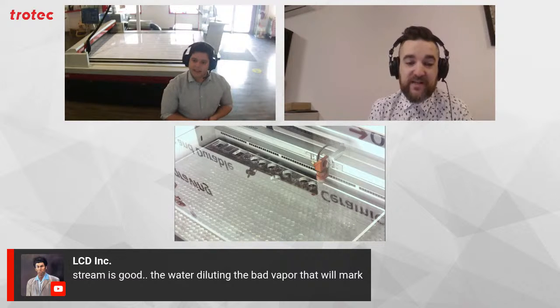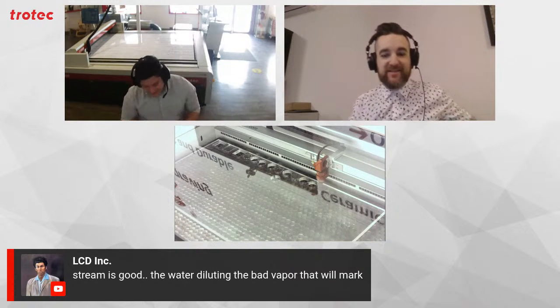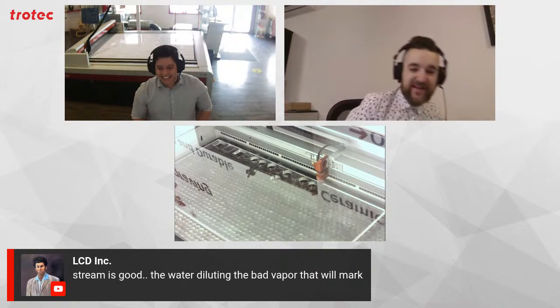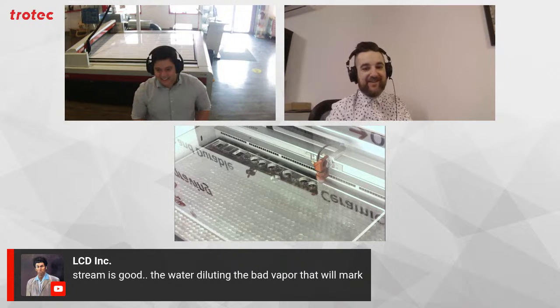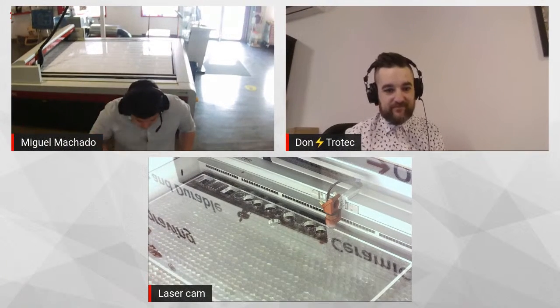Okay. So he's saying the steam mixes with that gas that's coming off of the acrylic, like you said. Right? Okay. Steam is good. It dilutes that gas that's coming off the acrylic, so it's not igniting in the laser. It still happens, by the way.